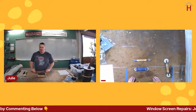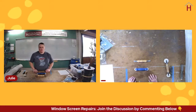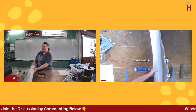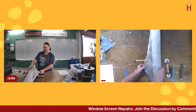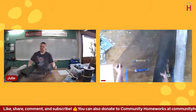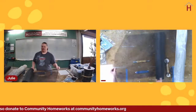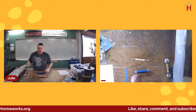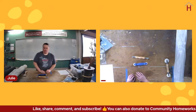There's also a style that has a metal wheel, and the metal wheel theoretically is more often used for a metal screen like this right here. It's a screen material that's made of metal. You may have seen it on your house. And the plastic wheel is typically used for fiberglass screen, which is right here. Basically one is cloth-like, made of fiberglass. One is metal and actually made of aluminum. And both come in a variety of colors. You can typically use either one for either application if you're sort of careful with it.